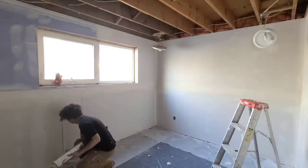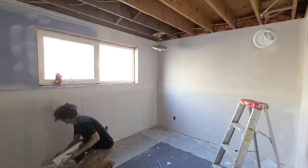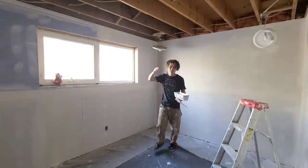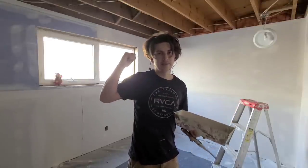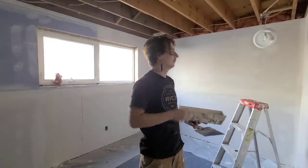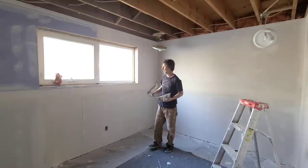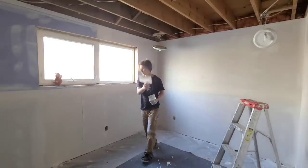And then after you're done all of the flats and all of the butts, if your inner corners are dry, you can do those as well. I do those three times, and sometimes you can do those at step two and at step three, so you don't have to do them at the same time that you do your skim coat, which is step four. It's a little confusing. But basically, as soon as they're dry, you want to do them again, especially if you're going to do them three times, because they take forever to dry because there's a lot of mud in there, depending on how well they can be flushed out. And that depends on how square they are.